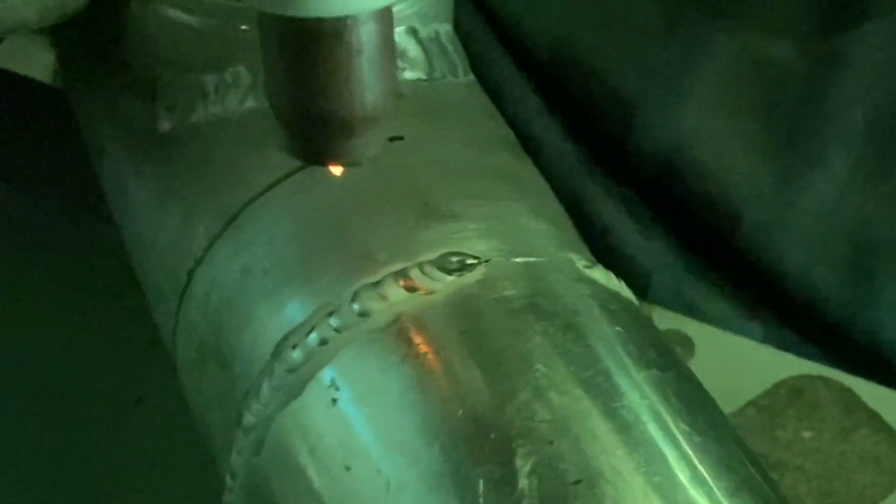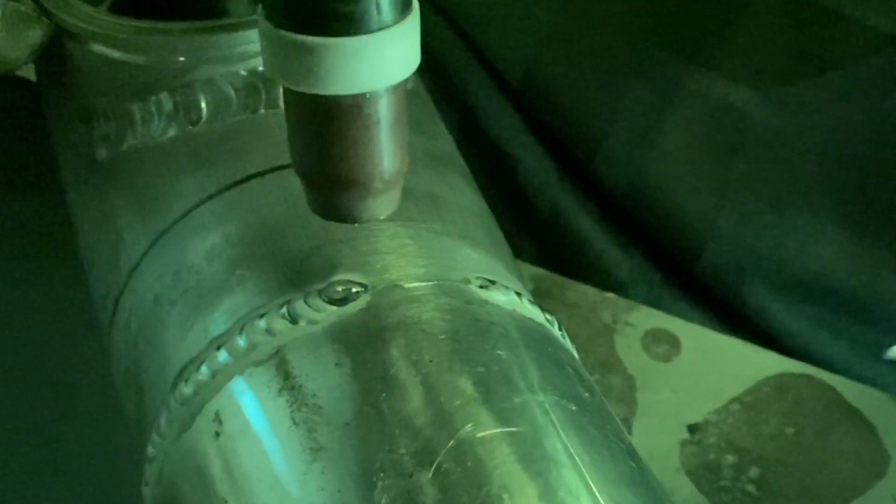And one of the things, you can really see it in this camera with the lens on it. I am pulsing the pedal, the foot pedal, the controller. It's still set on 90 amps, and I hit it to the floor right there when it gets bright. And then when it eases back off, I let off about half, and then that's when I move it back. So pulsing the pedal is hugely important if you don't have a machine that pulses for you.